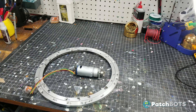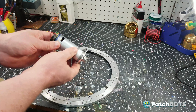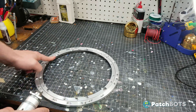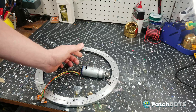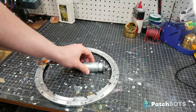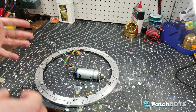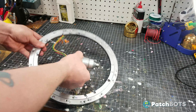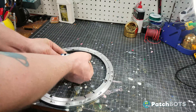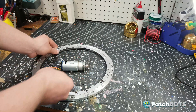The motor for this project is going to be this 1621 RPM heavy duty planetary gear motor from Servo City. This is a pretty beefy motor, probably beefier than we need, but I'm kind of locked in with the size of this Lazy Susan. I figured I'd rather have that power and not need it than need it and not have it. The trickiest part here is with the motor sitting inside of the Lazy Susan inside the hilt, we need to transfer the rotation of the motor 90 degrees so that it can rotate the saber, and to do that we are going to use some bevel gears.